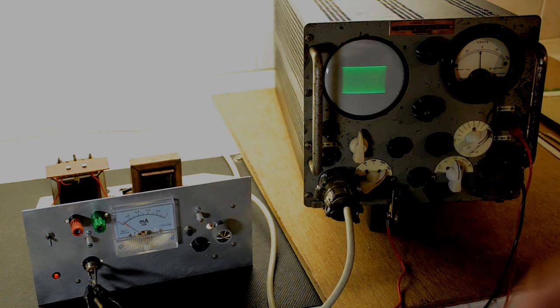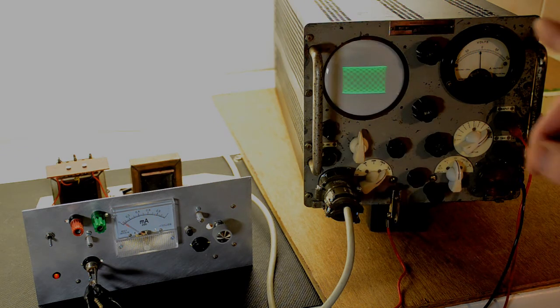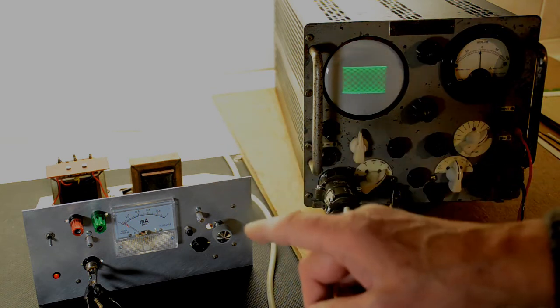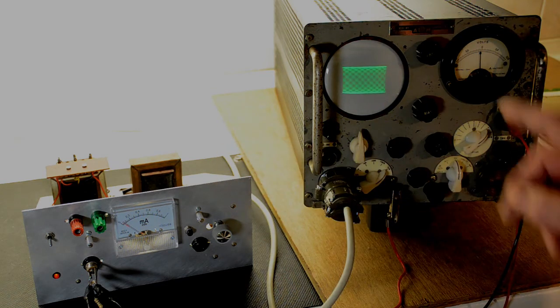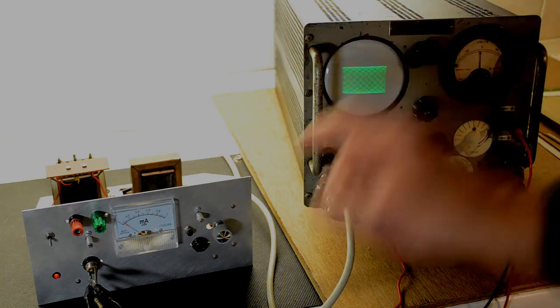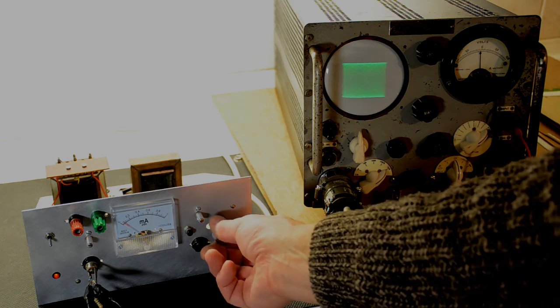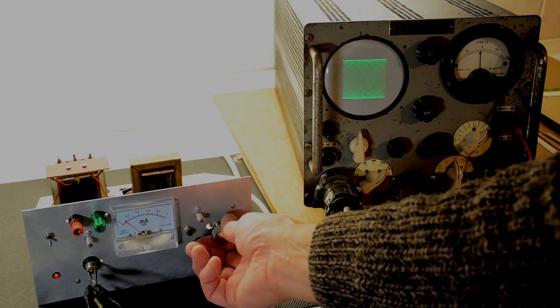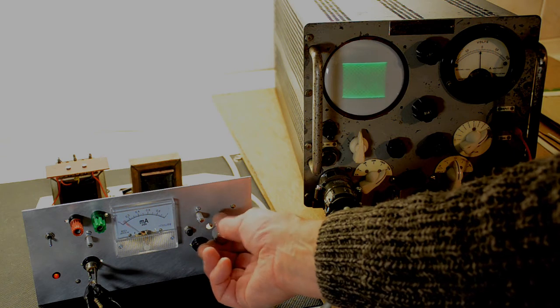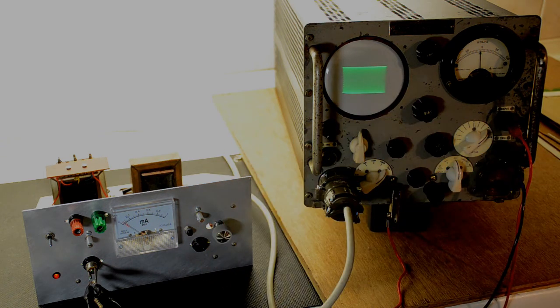Perhaps as a test oscillator, calibration oscillator, or simply a reference — that's fine. But remember with this type of phase shift oscillator: you don't want to peak your screen voltage to give maximum amplitude, because that gives the maximum distortion. This shows the difference — this would be about the maximum up here, but we'll be running it down there for the lower distortion figure, which corresponds to a much lower screen grid voltage.